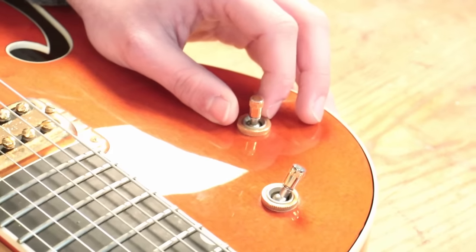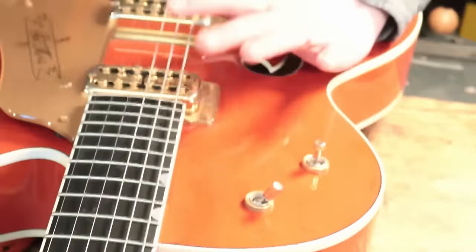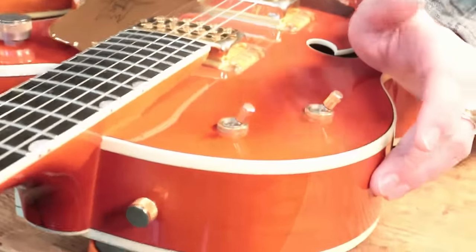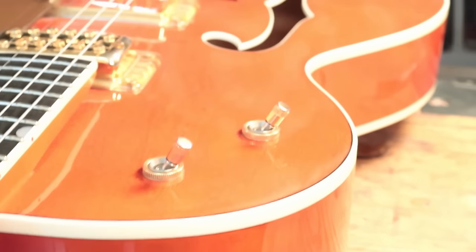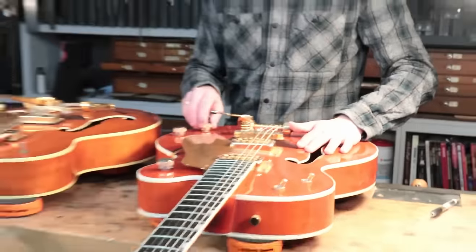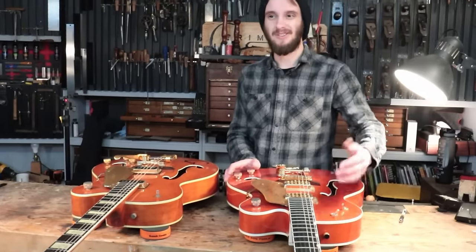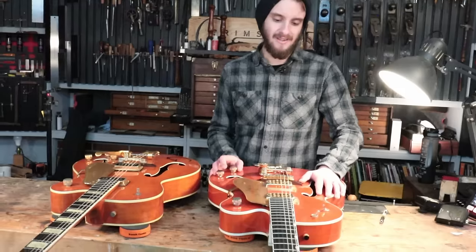Well, let's remove the flexibility by adding an even more expensive bit of hardware. It's a weird setup. So middle position, you've got just your standard pickup sound, nothing happening there. Up, you've got essentially a fully rolled off tone circuit, as if you'd completely rolled off the tone control if it were a knob. Then in the bottom position, you've got a slight tone roll off. So kind of a middle ground, if you will.